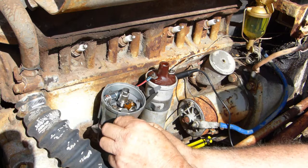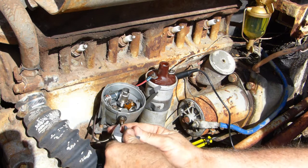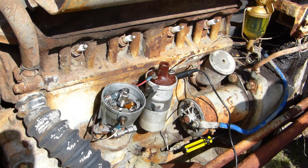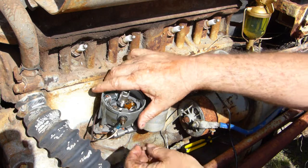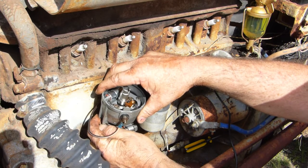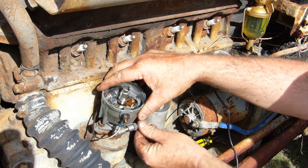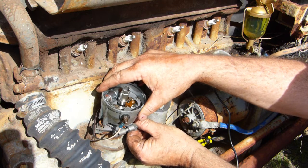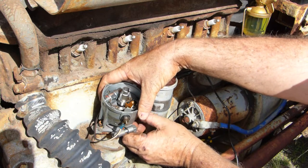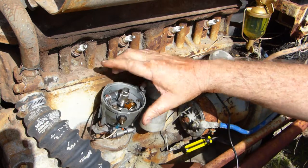Sorry, our distributor lead on. The test light's the next thing coming up, so that's why I'm thinking about the test light. We'll just get our trusty shifter and just nip that up. And also, at this stage too, it's a good point to do up these retaining bolts. Now, not up tight, just put them on, because when the distributor sits down in place, you can't get to them. So we'll lift them up. Okay, I'll do those up just so we can still move the distributor around, and I'll come back in a second.